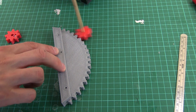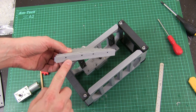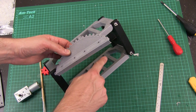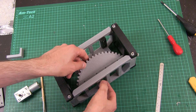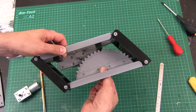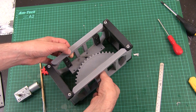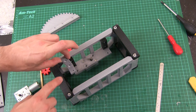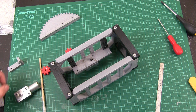Here are the printed gears — let's see how that runs. It seems to run okay, which is quite good. This gear fits inside; I've left some holes here and also made some brackets. Basically I will put some short bits of metal in there, which will act as a plug that holds it from slipping, then some L-shaped brackets that hold it on. I made one change from the CAD with these motor brackets — I did have L-shaped ones, but the gear hits them because it's quite close to this plate. So that was the only change I had to make, and I'm going to assemble that and see how it runs.